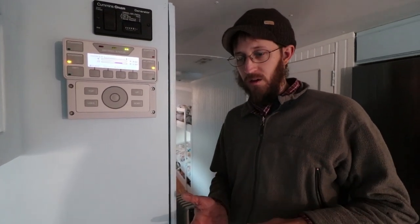Based on the calculation we did, you should be able to run your refrigerator, your computers, your camera batteries, a few lights, and the basics for a full day in the middle of winter. In the summertime you'll get more out of it. We sized your system to give you enough power for a full day with the least amount of sun you could possibly get on an average day.